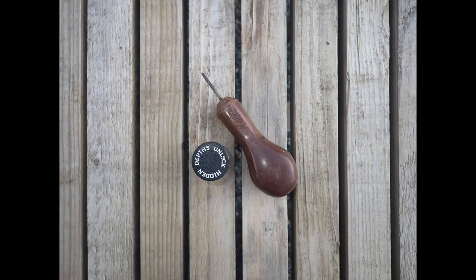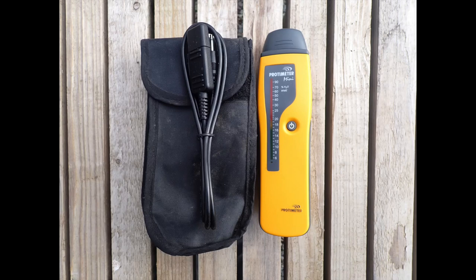The three tools most important to a wooden boat survey are the lightweight hammer mentioned earlier for percussion testing the wood, a small spike for probing any soft wood, and a moisture meter specifically for measuring moisture in wood. My spike is an old standard screwdriver with a small solid hard plastic handle and a tip that I've rounded off — it wants to be sharp enough to penetrate soft wood but not so sharp that it marks sound wood or varnish. The hard plastic handle also doubles as a mini hammer for tapping in hard to reach areas. I use an old cork to cover the end of my spike, as catching it under your fingernail whilst rummaging around in the toolbox can be quite painful. The Protimeter Mini General Purpose Wood Moisture Meter is a great little tool which gives a percentage moisture reading when the two metal spikes are pressed into the wood. Use it for probing along the bases of wooden bulkheads and other structural wood — it also comes out during a lot of FRP boat surveys as most FRP boats are built with wooden bulkheads glassed into the hull.